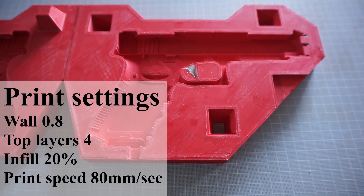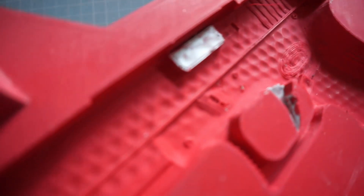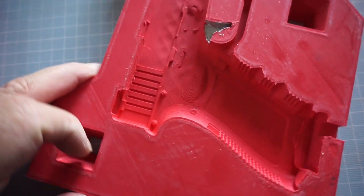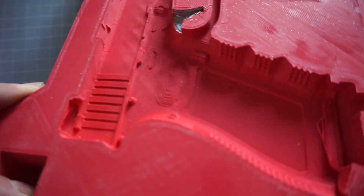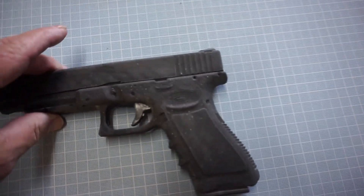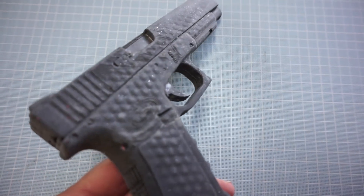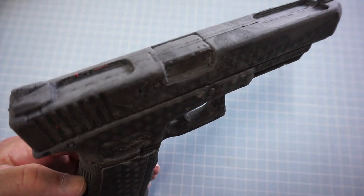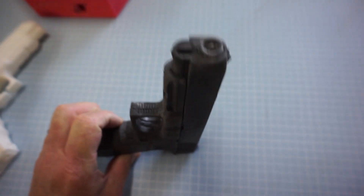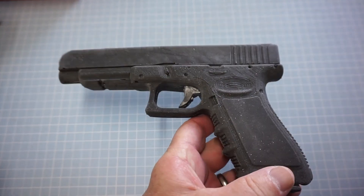Lessons learned: overall, the molds worked well. You can see the infill coming through, so the top layers need to be thicker, and I should also use a better material than PLA for higher temperature resistance. The aluminum powder looks too fake for a Glock, which is all matte black. I need to use more black colorant — the result is grey instead of nice and black. The aluminum powder I used to color the metal bits doesn't work; it looks too fake. The barrel needs to be a little bit deeper as it's too visible. But this is going to be used in the background, so details are okay. That pillowing is an issue. Overall, happy with it.